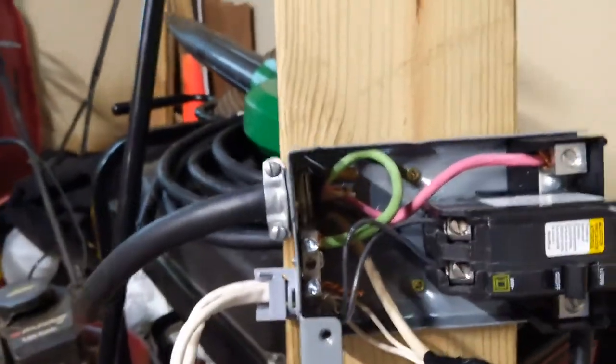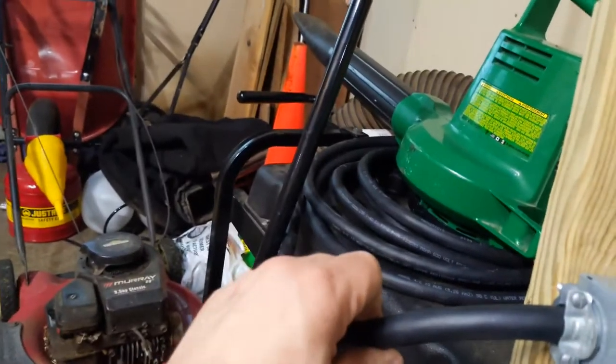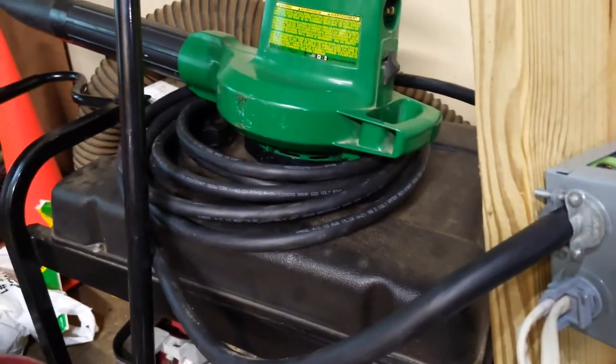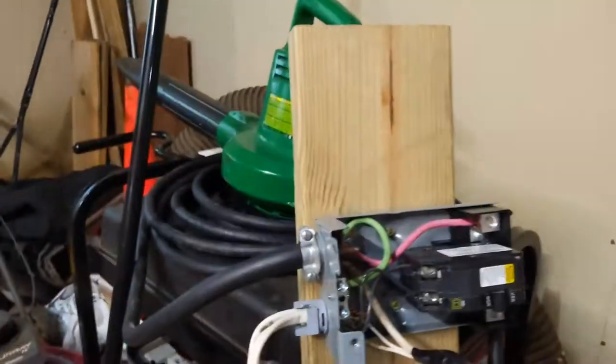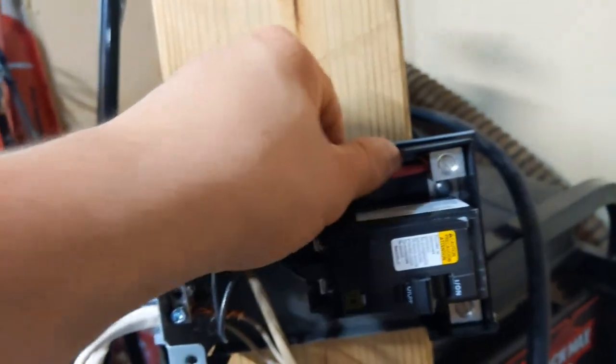The other one goes to this side. These are 15 amps apiece — you can put a total of 15 amps on each side for a combined 30 amps for the whole thing. This is 10 gauge wire; there's 20 feet of it, so I can have the generator outside chained to the deck, run this cable in, and have this panel inside — although I did design it to be rain-proof, and I just have the cover off so you can see it.